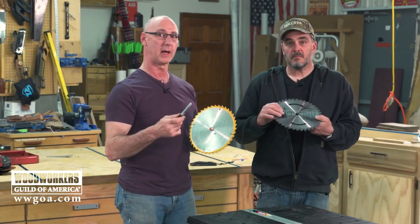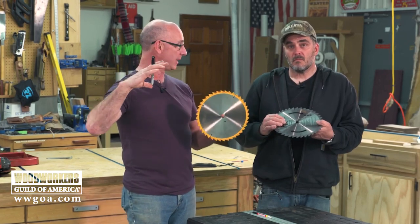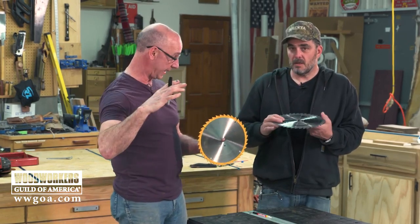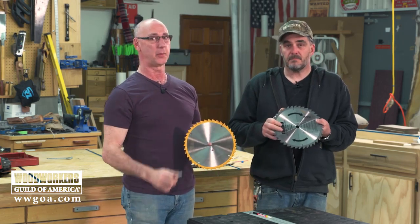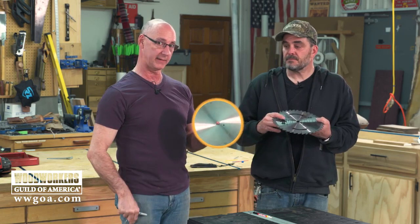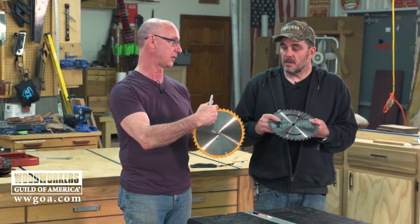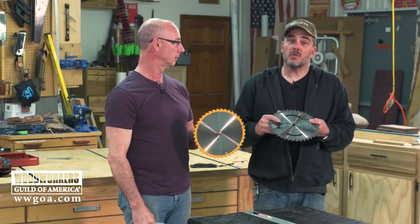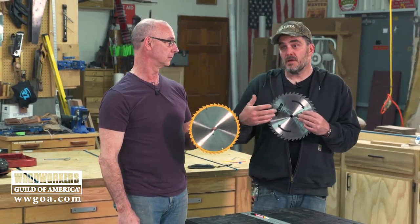One of the things you can look for if you want to do this is a big sawmill saw blade. Those are the ones that I use most, because they often aren't carbide tipped. You probably have a better quality steel throughout the plate than what we have here, because the strength and integrity of the tooth on this comes from the carbide. On those old sawmill blades, they will harden steel or tool steel throughout, so anywhere you cut, and plus you also have a much broader area to cut a knife out of, or even a meat cleaver.